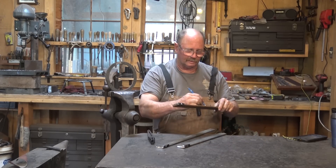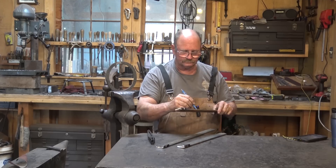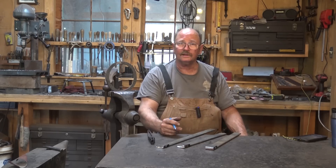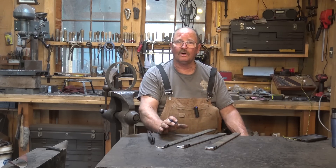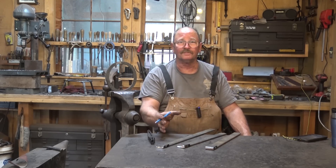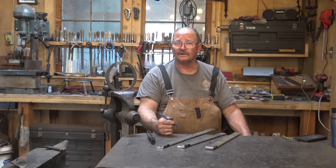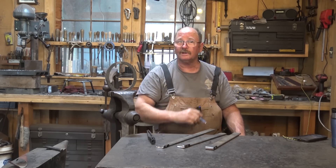On the third piece I'm again going to use the Iron Mountain flux, but I'm going to put it all the way around so I can see if it makes a difference to surround the joint, or if just putting it on one side is really all you need. We're going to bring these up to an orange heat, flux them, and put them back in the forge. I don't want to get them all the way to a welding heat because if everything is perfect they could actually weld like that — and then it might be hard to examine how far the flux flows. So at welding heat it might flow a little further — not a perfect test, but it's better than what I've done in the past. For 30 years I've never really explored how much flux you really need, so join me and let's see.